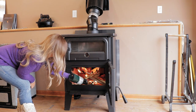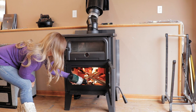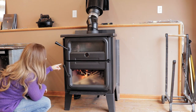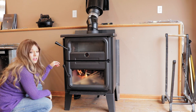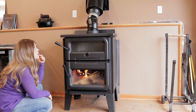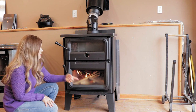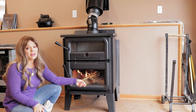And just like that, we have our fire going — no paper, really quick, about a minute or two. That went very easy. I'm impressed. Good draft, good airflow. It's actually pretty cold today too. A little bit of condensation on the glass because it's cold today and this is the first burn in this stove, so the outside air temperature around the stove is cold and the chimney pipe is cold as well. Sometimes stoves can be a little more difficult to light, but having the damper control on the bottom where it brings in combustion air from below makes it much easier to get the fire lit.